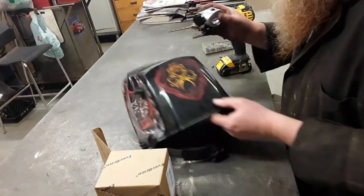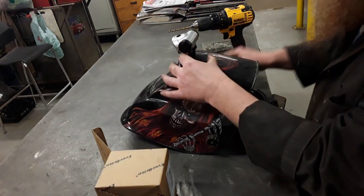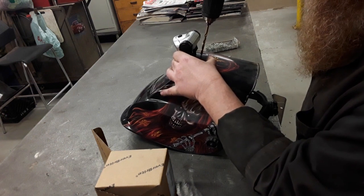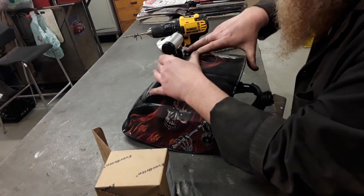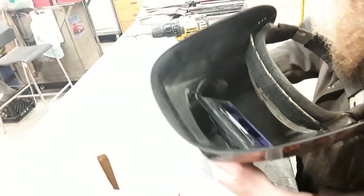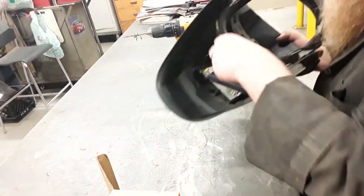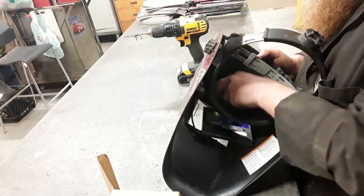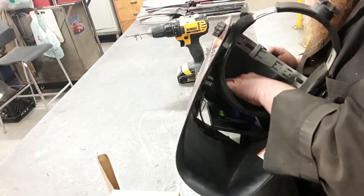Right about here, right way around. And I got these 8-32 screws which I'll use. I'm just doing this quick and simple — I'm just going to use two screws, I think. Let's see how far that sticks through. Yeah, that one hit my head. I'll put a nut on there to hold it in place. When I drill this, I'm going to drill the second hole — at least it's partially held in place.